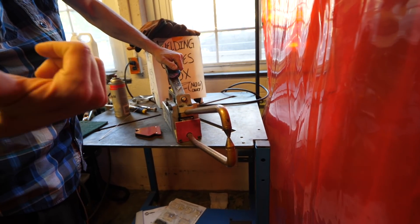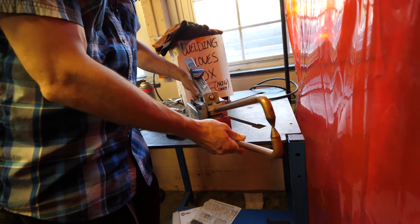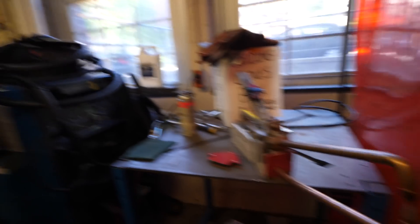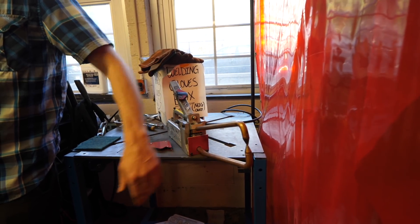Going back to super basics — this is a spot welder, which is used in manufacturing. My car has like 30,000 spot welds and you had to drill them to take them out or replace them. This ain't bad — if you ever wanted to get one, it's heavy but it's good. I got this exact model for like $300 used. You could also try the Harbor Freight one for like $175 — it comes with a lifetime warranty, but you can't really do that. They're very simple devices — essentially a transformer. You can change the arms and replace the tips when they wear out — it's all about contact, so if there's oxidation you've got to get that off.